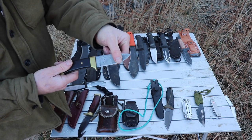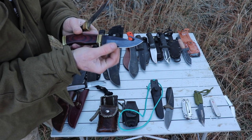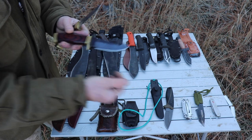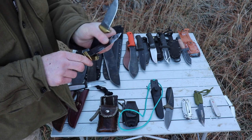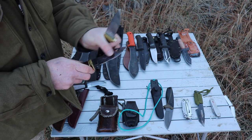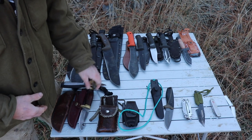This one has a flat grind — just flat all the way down — and on this one it's a hollow grind, so it's pretty thin down towards the bottom. It's going to shave a lot better, but it's going to be a little bit more brittle and not as durable as a flat grind. But all in all, if you're careful enough, a hollow grind will last you just fine.